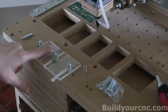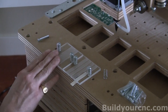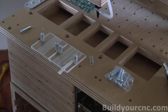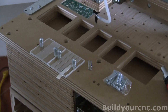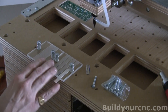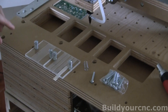So when your devices are running through the guide, the end effector is going to be able to get it at the right place every time. To do the same thing to the rest of them, you'll need eight nut inserts, eight springs, eight spacers, eight washers, and eight number 8 screws. We will most likely provide the two inch screws instead of the one and a half, so you'll have a little bit more play or versatility. You'll need eight for each side, so 16 on both sides.